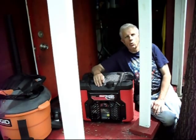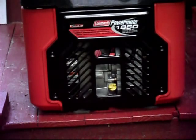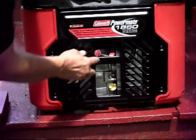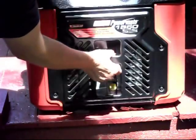I have not started this thing in quite a while. The first thing you want to do is to turn the petcock on for the gas. What I had done here, shortly after I got the generator, is I added a gas filter in addition to the petcock that was already there. There is a gas filter — or was a gas filter — in the tank. It's a little vertical screen, about a quarter inch in diameter and about an inch high or so. Well, it fell off, so it's impossible to get back on. So what I did is I added a gas filter right here.